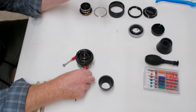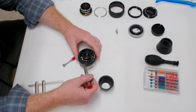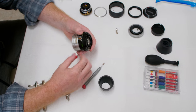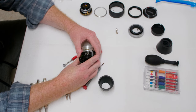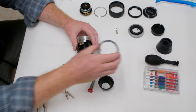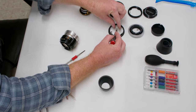Important: there are two ball bearings that operate the aperture click. They're found under the ring we're about to remove and may get stuck inside the ring or stay seated in their little divots. A spring under them keeps them loaded — that's what gives you the clicks and prevents the aperture from moving freely. With aperture numbers facing up, lightly pull the ring. I can see both ball bearings clearly. They're often magnetic so I just use my screwdriver tip to retrieve them and put them in the pile.